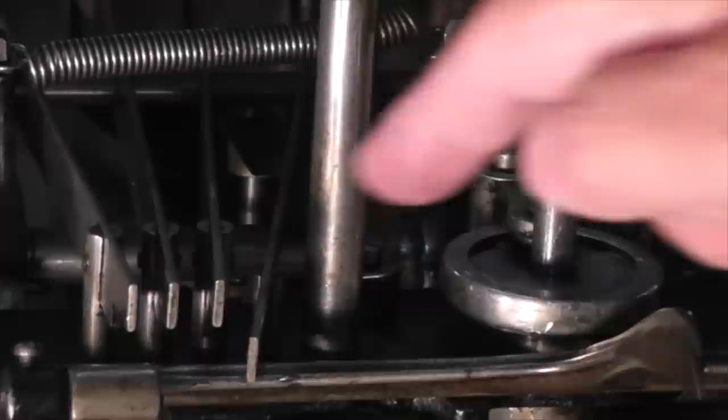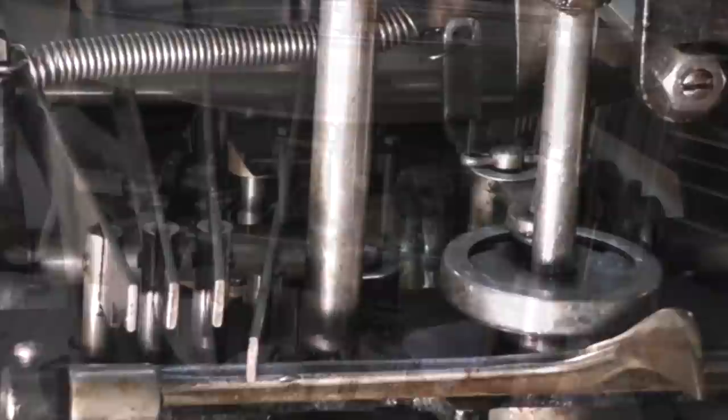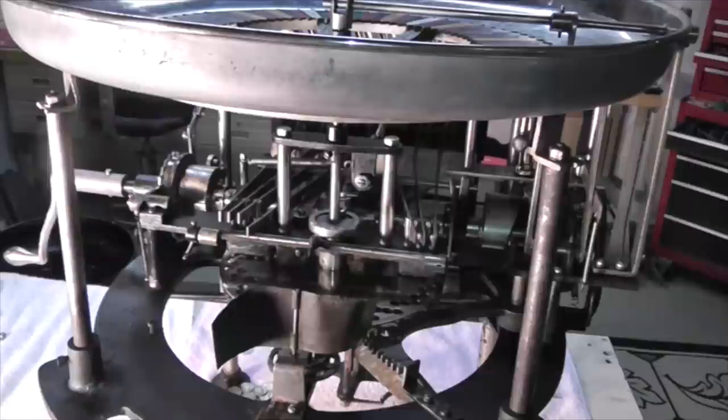But the finger on the right here of these four is actually dropped down because we hit a winner. That one corresponds to the 00. When that went down, that raised this lever up, which then released the timing clock. Another kind of interesting thing to point out is how the wheel actually gets energy to be spun around.